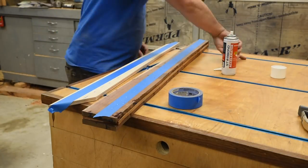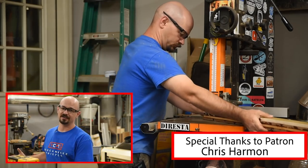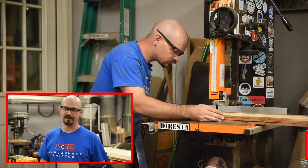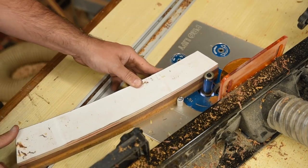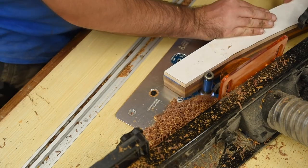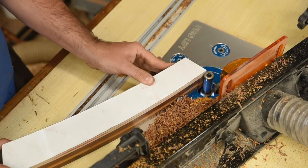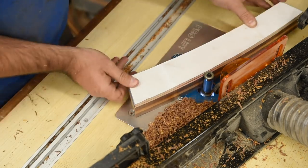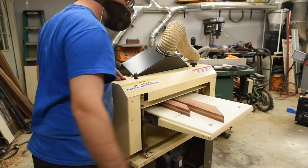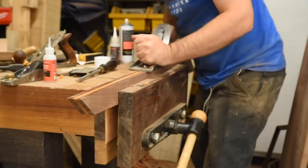Now it's time to fix my other mistake and get it caught up. This is this month's Patreon contest prize — there's more information in the description, but basically become a patron, find the contest, leave your answer, and if you win, you'll get the prize. For final shaping, everything makes it to the router table to be template routed. A freehand router would also work, but my router table has pretty good dust collection when I remember to open the blast gate. With the leg pieces to final shape, I put the drum sander head in my Woodmaster and give them a quick sand. I also hit the straight edges with my joiner plane just to make sure they're dead straight and smooth for the glue-up.